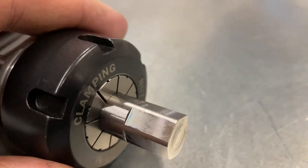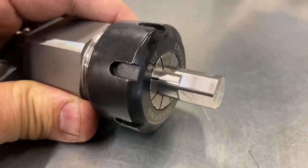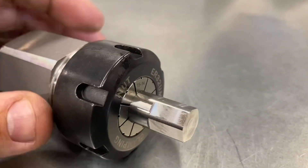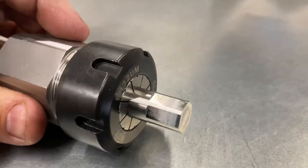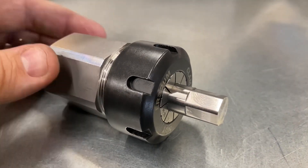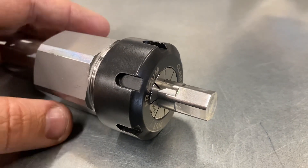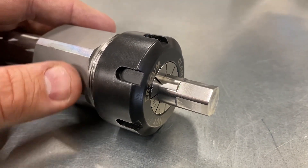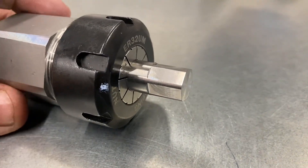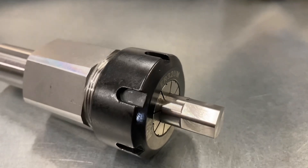That's been back in the mill now and as you can see our flats are nice and even. The repair job on the collet block worked an absolute treat in the lathe — there's a little trick for you. If you get a collet block and want to make sure it's absolutely spot on, you may need to set it up to do some machining. On the square one I got I also had to machine that, but in the milling machine rather than the lathe because that was the flat faces rather than the corners. This is a quick and easy modification to do to these collet blocks to get them to cut nice.